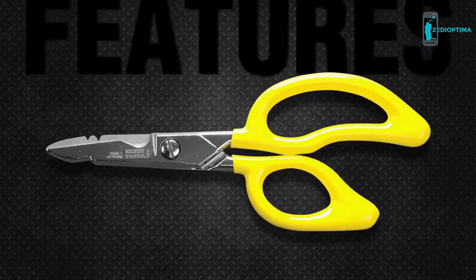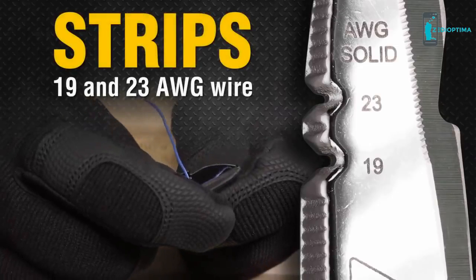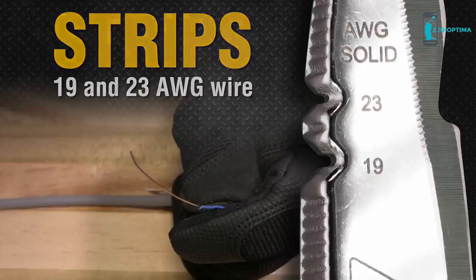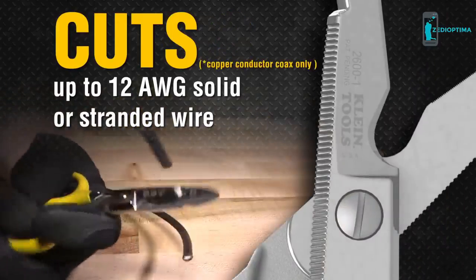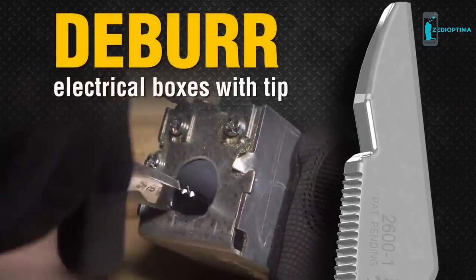This multi-purpose tool is packed with features. The stripping holes strip 19 and 23 AWG wire, two of the most common sizes. The cable cutting notch cuts up to 12 AWG wire. Use the notch in the tip to deburr electrical boxes.